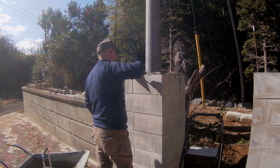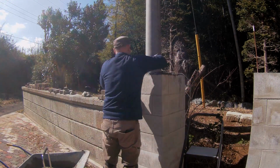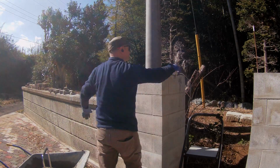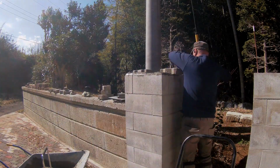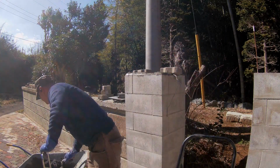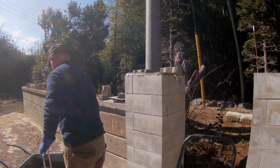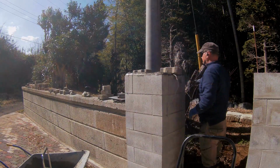Once I got a good amount of mortar on, you may notice that I put a couple of blocks to hold the cap above the mortar for a little while so that I could feed the electric cables through the center of those caps before laying it finally in place. It's one of those situations where you need about 8 hands to try and do several things at once.